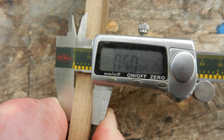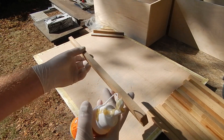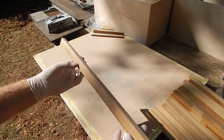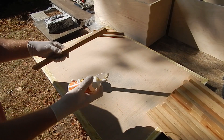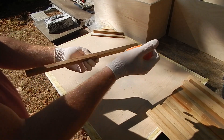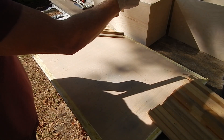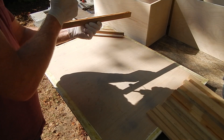I started with half inch cedar strips. This is northern white cedar and it's a very light wood, very rot resistant, not particularly strong or stiff for its weight, but pretty good. And I'm going to simulate the strip planked panel by gluing, edge gluing these strips.